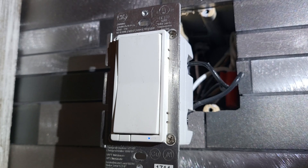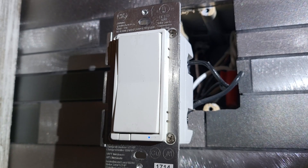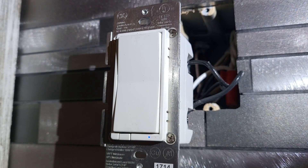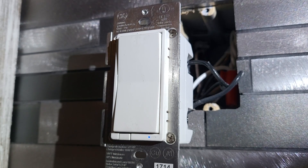So there you go — now you know. Electrolytic capacitor C7, 10 microfarads, 25 volts — that's what needs to be replaced. Hopefully it saves you $35. Like I say, GE Z-Wave switches are notorious for doing this. Why they didn't engineer these things better is beyond me. I don't think you have the same issues with the Levitons, but there you have it.